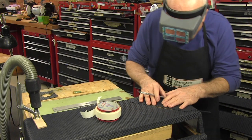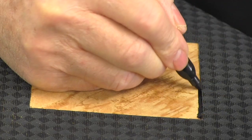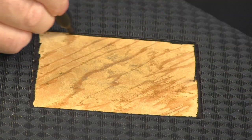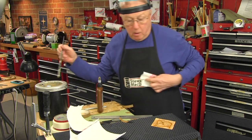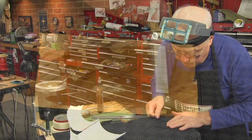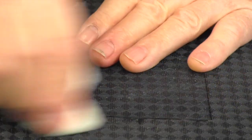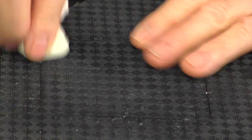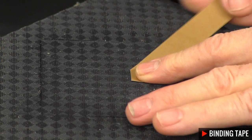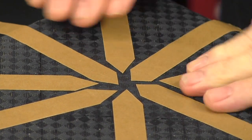Lay the patch piece over the cutout area and use the X-Acto blade to cut it to fit. Don't forget to match the pattern. Before you glue the patch on, mark around the outside edge with a dark Sharpie — that will help hide any gaps in the patch or if any wood is peeking through. Spread the glue with a brush, and I keep my brushes in the glue pot with hot water for easy cleanup during the job. Press the patch into place and knead the edges together so the patch fills the whole area. Quickly clean up any squeeze-out with a little hot water and a clean rag or paper towel. Dry off the area and add some binding tape to keep the patch stretched. I cut the tape to a point so the pieces don't overlap — they meet in the center — so if I need to use a caul and clamp on this later to put pressure on it, the tape won't leave uneven marks.